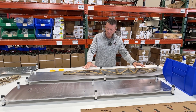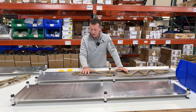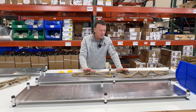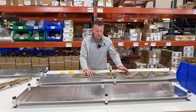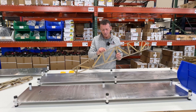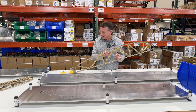I've got some stats on these. The new rib sets for the cub — our rib set — comes in at 17.6 pounds. That puts them slightly heavier than the original Piper Cub rib. The difference is that we beefed up the cap strip here. A lot of people like the cap strip a little bit heavier, and Piper did this in later models just for snow load and things like that.